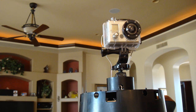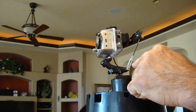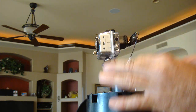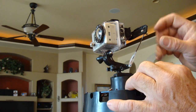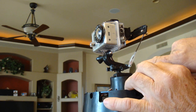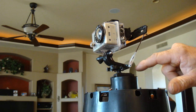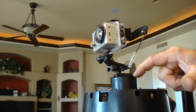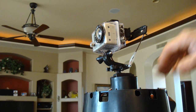What I did is take a standard GoPro casing and use an existing offset clip — see how it goes back like this? That's so I could get a good connection from the servo with the linkage. This flexible plastic extension allows greater movement up and down using only a quarter-inch servo, and I drilled and threaded it into the bottom of this GoPro clip. I mounted this clip onto another servo that I mounted into a piece of inch-and-a-half PVC that slips onto another inch-and-a-half pipe to make a long pole and take some good aerial views.